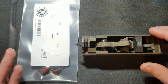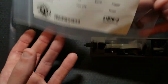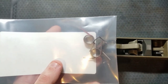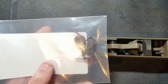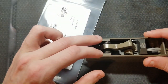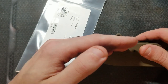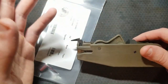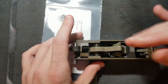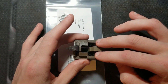To reduce the weight of the trigger pull, I got the Steyr factory upgraded trigger spring kit. I had to wait for a couple of months for this to be in stock on the Steyr USA website. It was $56, which is pretty expensive for three springs. Of course, if you reduce the weight of the two hammer springs here, you're going to be reducing the force with which the hammer hits the firing pin and then the primer. So there's an increased possibility of light primer strikes